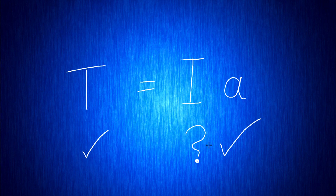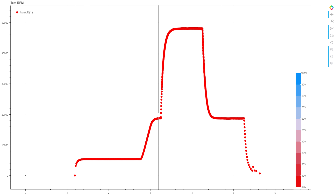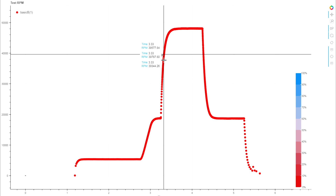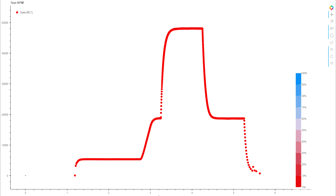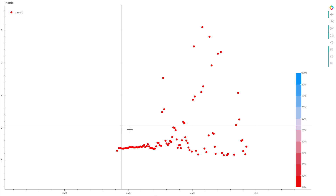As long as the result doesn't change regardless of voltage, throttle position, or RPM, we have good confidence in our number. Now let's step through actual recorded dyno results. There are some tricky bits we have to compensate for before getting an accurate inertial reading. Our test program ramps up to an idle speed then snaps up to 65% throttle with no throttle smoothing — going from 25% to 65% — giving the motor the hardest possible acceleration. Testing the motor completely unloaded with no prop and no brake disc gives a nice flat inertia response.